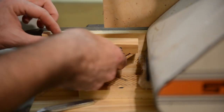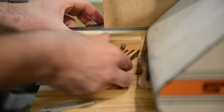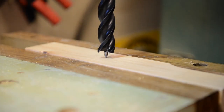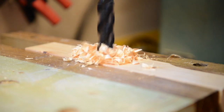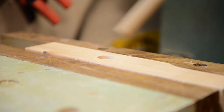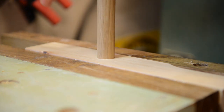Because the power feeder has to be so close to the fence for our narrow one-inch stock, we only had room for two short sections of featherboards — one at the infeed and one at the outfeed. To make sure everything was working properly, I wanted to do a real-world sizing test rather than simply relying on calipers. I used a Wood Owl bit that I traditionally use for drilling peg holes, drilled a hole in a piece of pine, and tested some of the first stock out of the machine. Everything worked great, so I carried on with the rest of the stock.